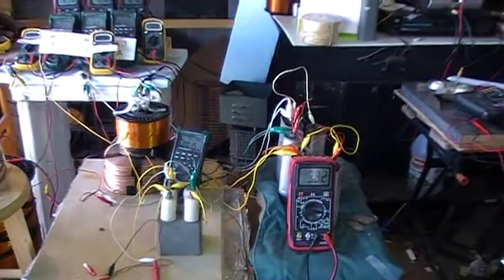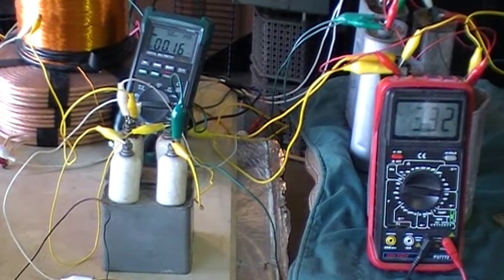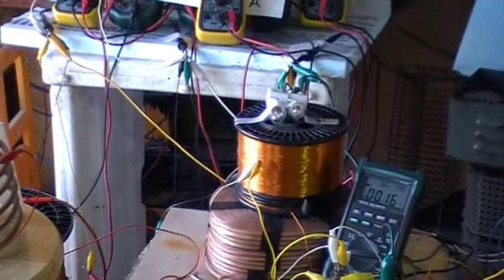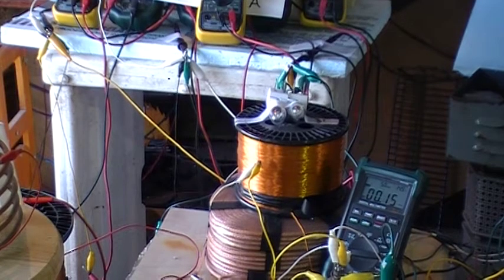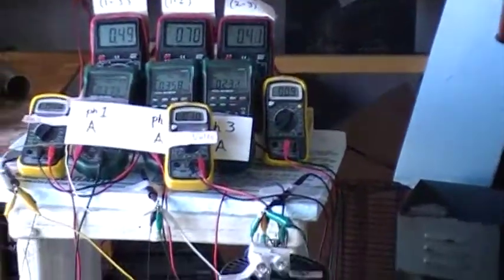We have first the voltage across that LC loop. On energized field state, we have 332 volts. 332 volts is not yet engaged across the incandescent bulb load. The reason for this is so that we can note the full amount of circulation of the secondary without being loaded down by that incandescent bulb. We've also got an amperage meter on the incandescent bulb, and every 6 volts is equivalent to 1 milliamp in this frequency.